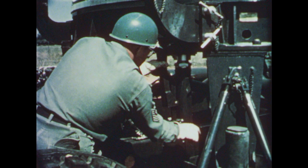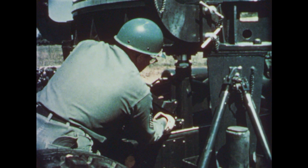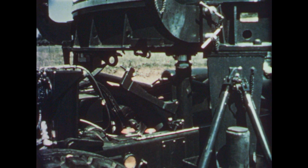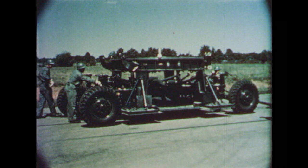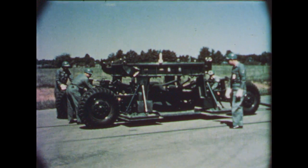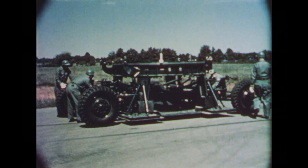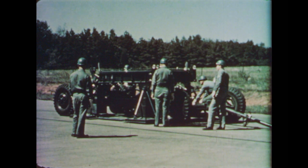Four locking arms, one at each leg of the launcher, are released by removing self-lock pins and pulled back from the ring before the launcher is lowered to the ground. Before the launcher can be lowered, the transporter hydraulic system is relieved by operating four hand valves. Primarily, the purpose of the launcher is to support the missile and provide a means of missile rotation for azimuth alignment.